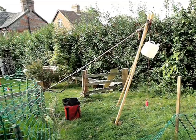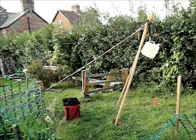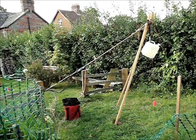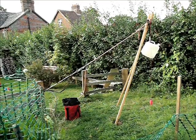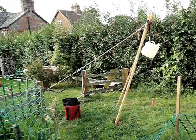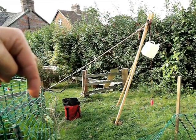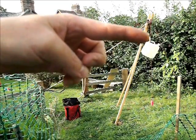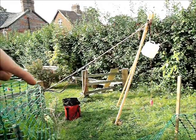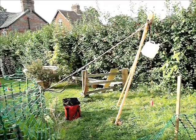You can see the angle there. If that was out in the real world on a hard surface, you'd start to worry about the feet skidding away. That's reading just over seven kilograms on the spring balance. So we're approaching 70% of the weight of what's on the hook being transferred down the line to that post. So if you had a ton up here dangling on a chain hoist, that would be transferred to the tow hitch of a vehicle or a bit of building — you've got to be careful.